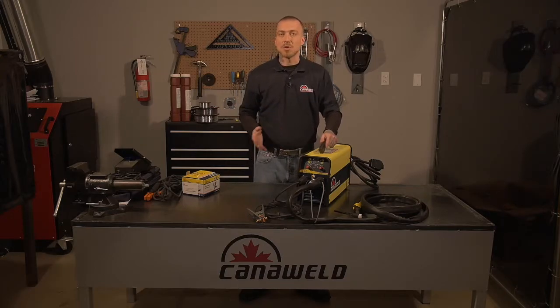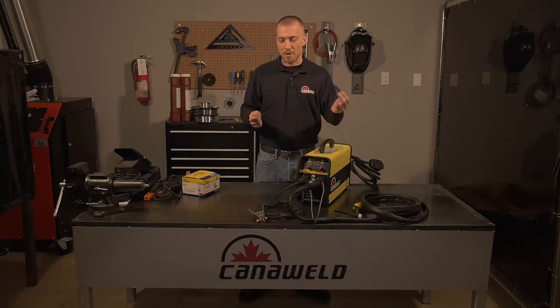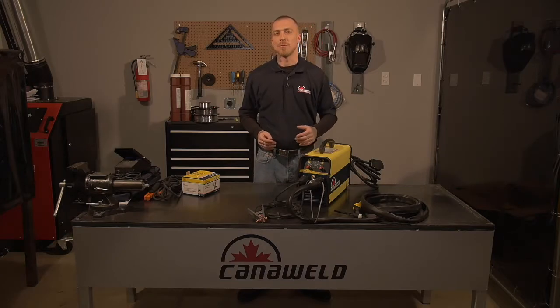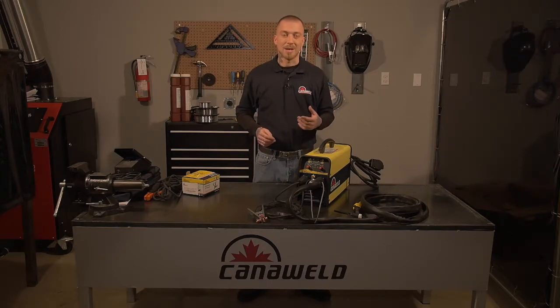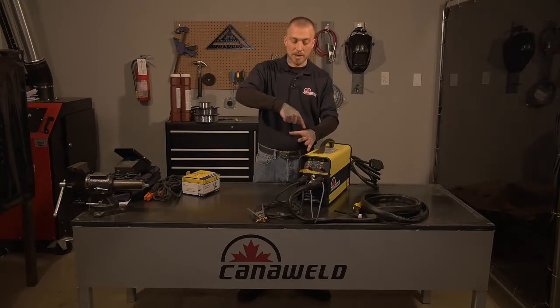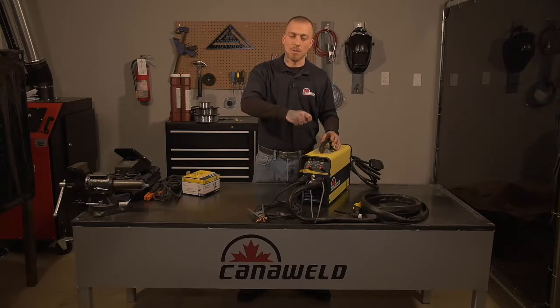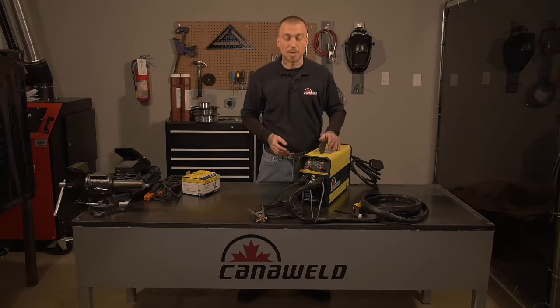The machine also has pulse welding capability, which is great. Pulse welding allows you to run a quicker bead and get a really nice finish without having to add all the extra filler rod. That means if it's something you need to grind down, there's less for you to grind, and it also looks really nice. You can get a much nicer finish with less training when you use the pulse technique. Pulse is also really great for working on really thin metals that you may be worried about burning through — it allows you to control the heat better. So if you're welding around an open circle and you don't want it to distort, you put it on pulse and it'll help keep things cool and help everything flow smoothly.